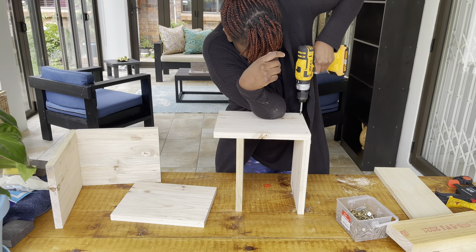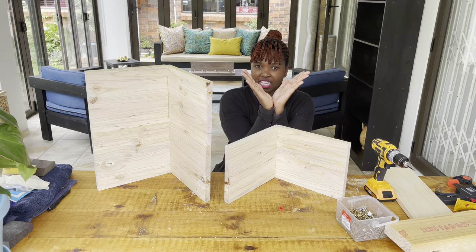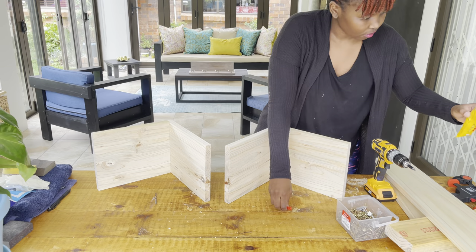Please remember to put wood glue between the two mating surfaces so that your bond is strong and tight. After you're done putting everything together, you should have three similar shelves which are in the form of an L-shape, or you can even call it a V-shape.